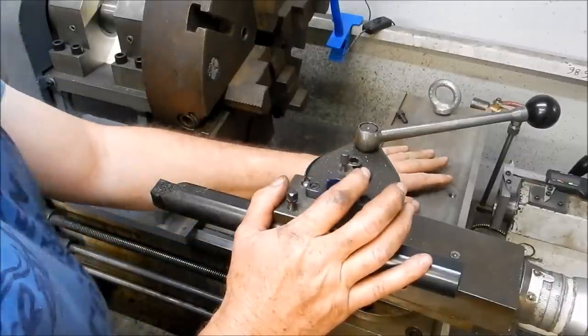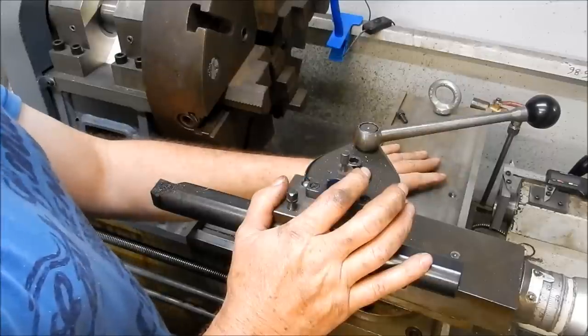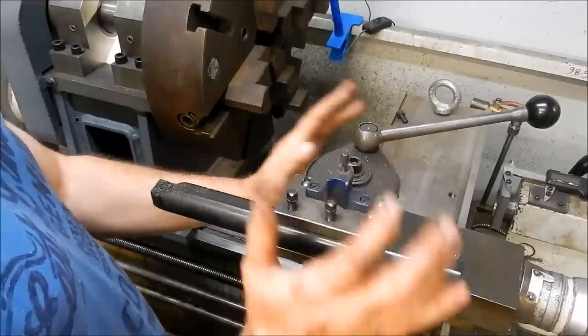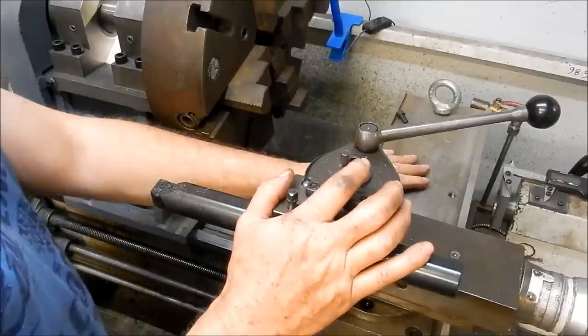This is very heavy. You want to reduce vibration, get some mass behind you. So this extension is very heavy. It adds a lot more mass to this cutting area. It takes out any vibration that you may have and makes the whole show so much more rigid. So in this particular case, yep, I've gone with mass.